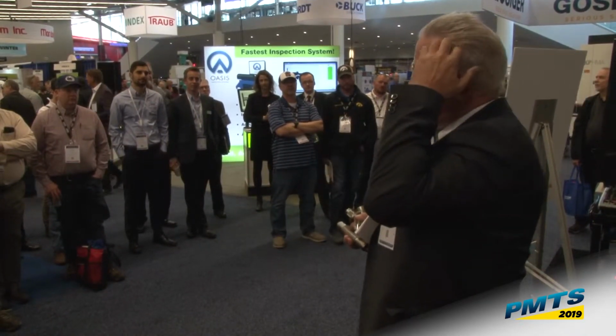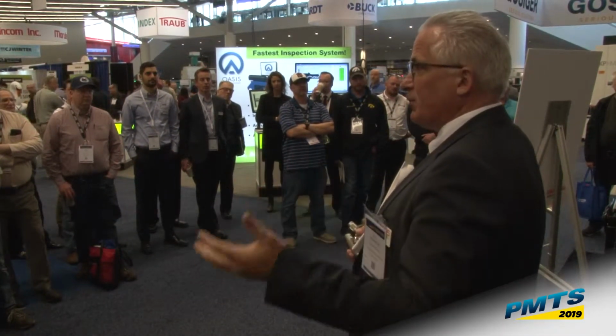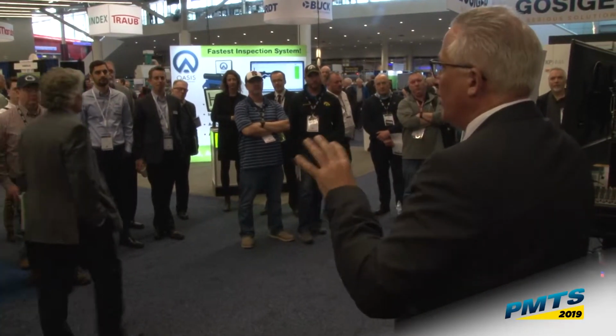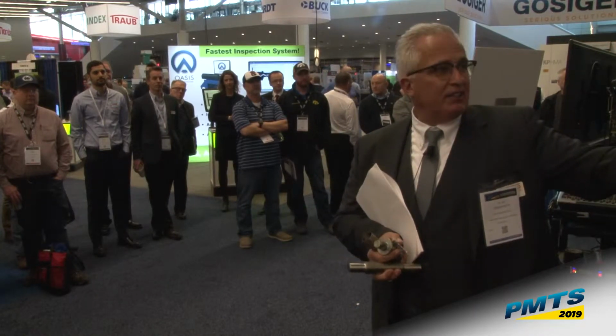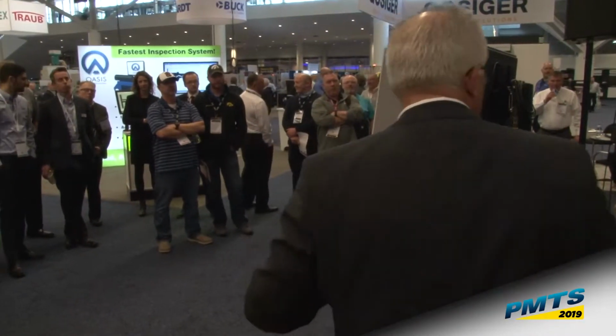So now comes the next question. What do we do with our bar loader and all the other stuff? Well, as you may know, ZPS, Timax ZPS also owns Pietro Cucchi, which was bought 5 years ago. So we had our friends in Cinisello, Italy, design a bar loader that doesn't only hold the bar, but also holds the high pressure coolant, chip filtration, and the chiller. The chiller is used for the 2000 PSI high pressure coolant and to chill the control cabinet, so you have no air coming into the control cabinet, which is, by the way, down below.